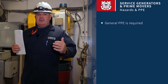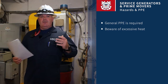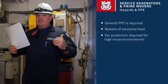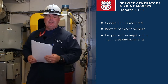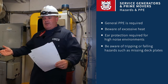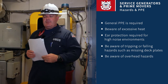Some hazards to be aware of: you'll be operating usually in an engine room. It could be a heat stress issue depending on how hot it is in the engine room, depending on where you're located and time of year. Also be aware that it is a noise environment, so you may require hearing protection depending on whether or not machinery is running. Also make sure deck plates are around and watch for any tripping hazards, overhead hazards, and things you might bump your head on.